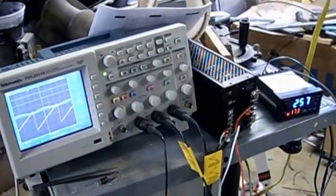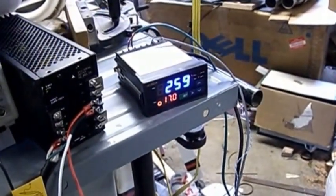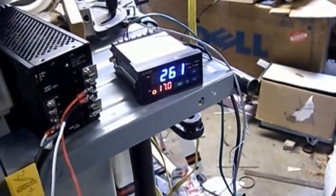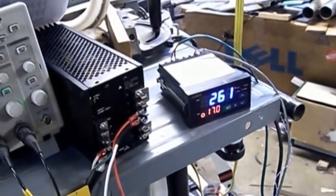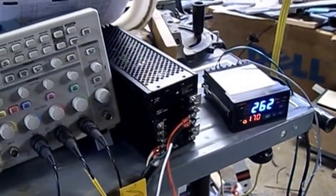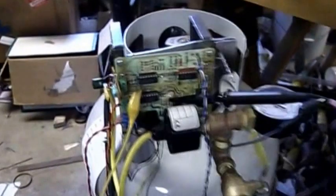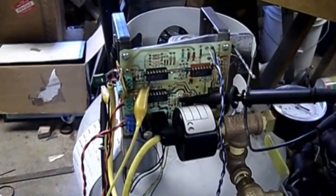Checking back in - we are now at 259°C. The gas valve is at 17, so it's not cracking open too far. This kiln can hit 2550°F so it's just barely puttering along here. Let me explain a little bit about how this is set up. We have a power supply right here, and that's actually powering up this gas controller, which has a couple of probes hooked to it. I just want to verify it because this is the very first time it's been running for real.